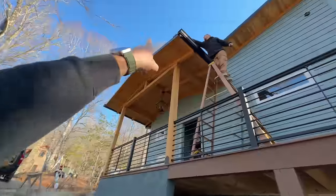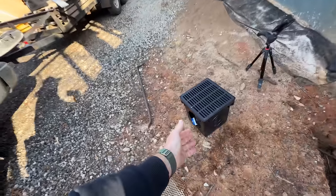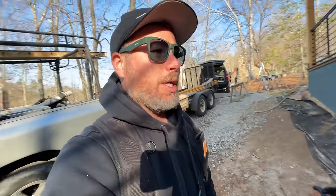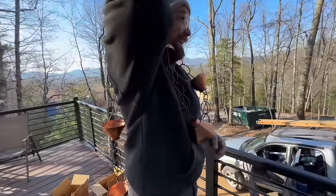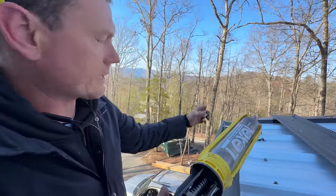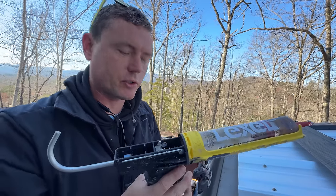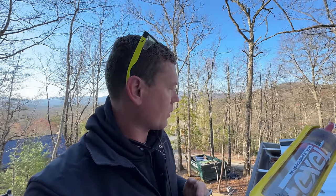We're back at the job this morning doing a little gutter work. This gutter doesn't have a regular downspout because the homeowner wanted a rain chain with cups — the rain just goes through the cups and down to a ground collection box, into a pipe that comes out way down there. It's a pretty complicated system but it looks better than having a gutter downspout right here. The first step is to Lexel this copper piece — it's like a funnel that covers the square area where your downspout is and funnels it down to about a two-inch round diameter.